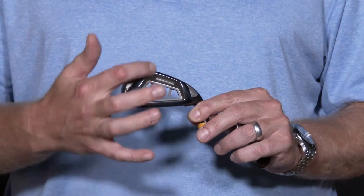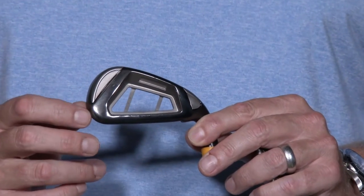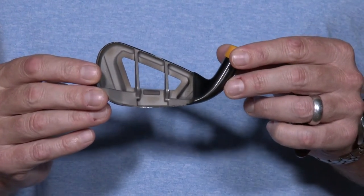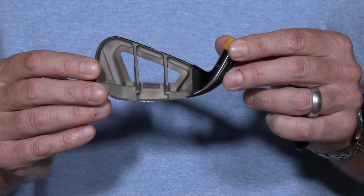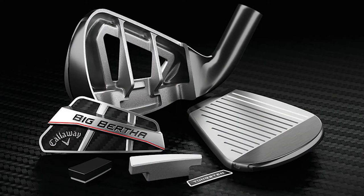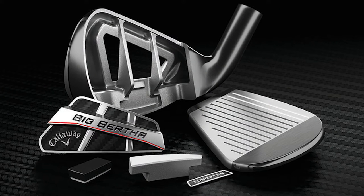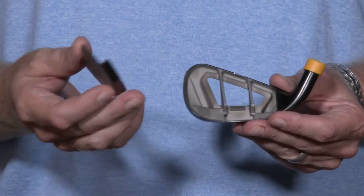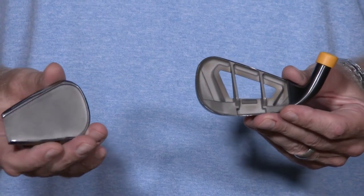This is a sort of a hollow construction but a little bit different than the last one in that we've taken some of the weight out of the back so it's not truly hollow. We have what we call an exo cage which has two beams that run from the sole to the top line that stiffen that part of the club head while also reducing weight, so we can take that weight and put it elsewhere in the head. Stiffening that part of the body reduces twisting on off-center hits so that we get better energy transfer to the ball. It also allows the face to work more effectively so the cup face in this iron flexes not only a lot but flexes as we want it to, to get the ball speed as and where we want it to.